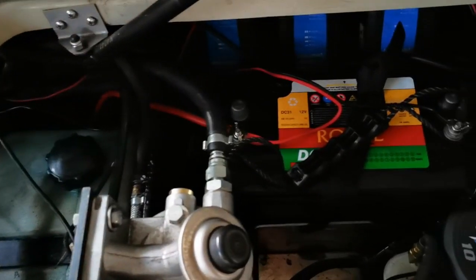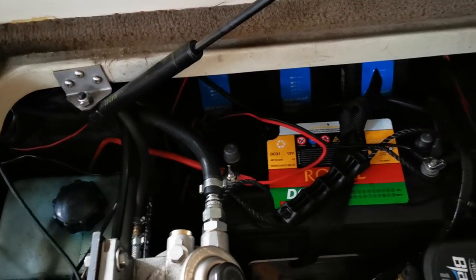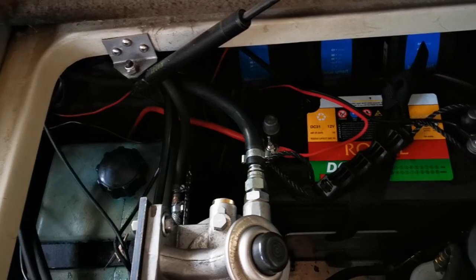So my 12 volt batteries are running my main motor, all of my Lowrance marine electronics, HDS system, Sonic Hub, all of my network systems and all that. Then I've also got 2 Power-Pole Blade 10-foot shallow water anchors, which are over there. That's why I've got 2 in parallel, because I've got quite a lot of load. Plus my live well pumps run all the time.